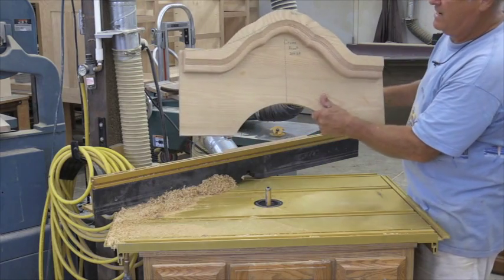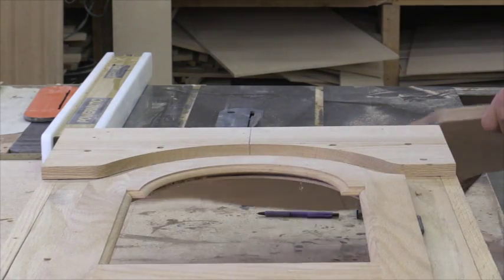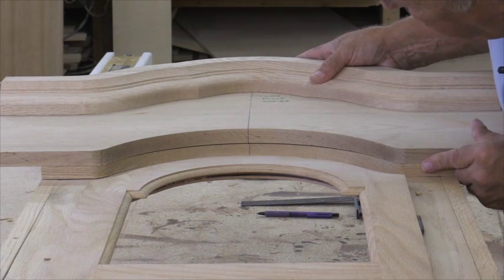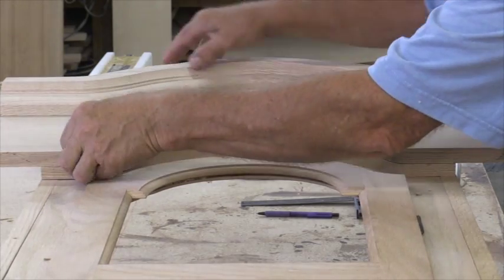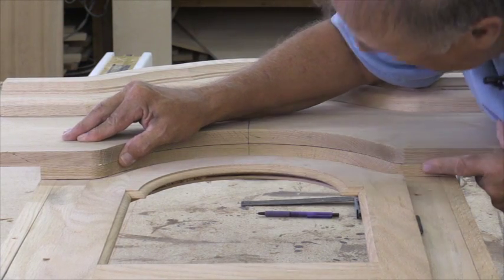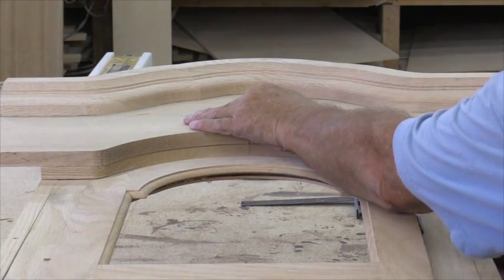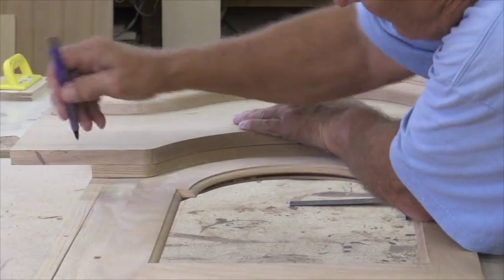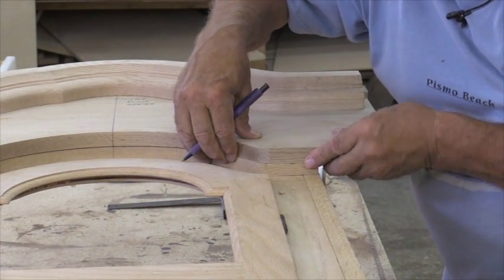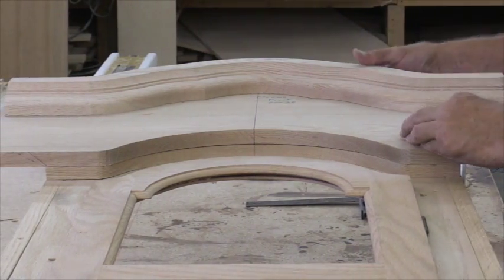Okay, we've got our molding all cut now. Now we're ready to cut the miters on our crown plate. We have our clock laid down here — remember that half-inch plate that we put on there. It gives us a little bit more dimension, and also tells me exactly where I have to put this bottom plate so we're lined up right here. We're going to mark underneath here where that 45-degree cut is going to go — right there is where our 45 is going to be cut.